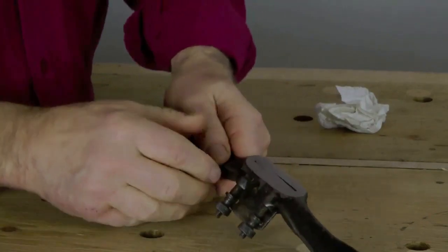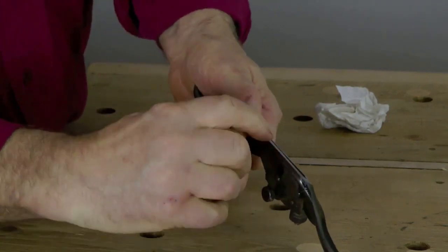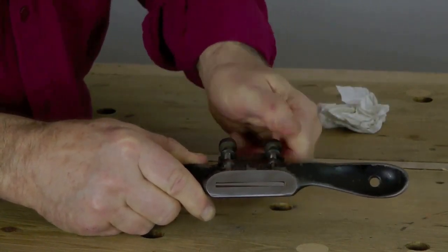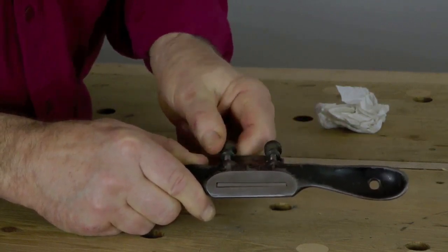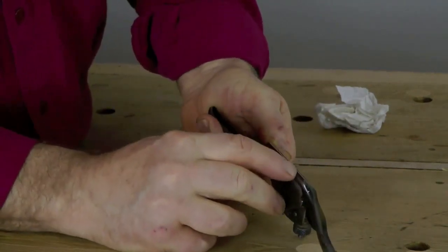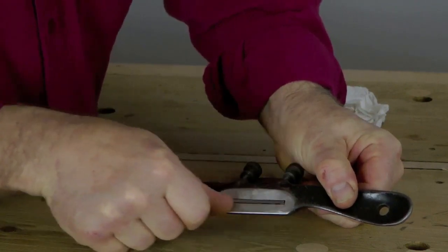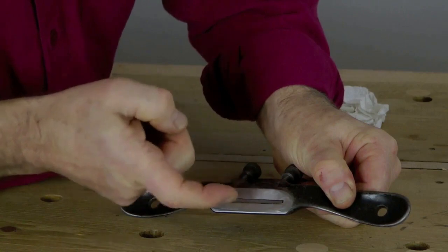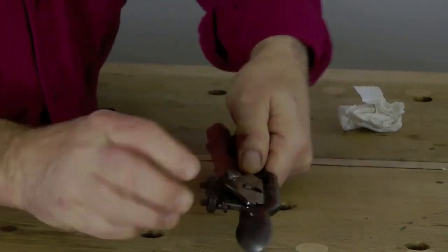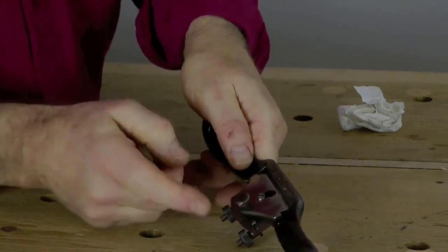So turning it over, because I can't show you this to the camera, I look down across this front edge here, and I see how much blade is sticking out, and I think you can see here that I've got a lot more on one side than the other. So if I was to pull this back this way here, and push this one forward, I could even up that blade. Then I sight down here, across there, and I just see a little bit, like a hair's breadth of blade sticking out. And there should be a gap between the front of the spokeshave and the edge of the blade for the shaving to go through. So that can't be too close. So that's essentially it, and I will try that on a test piece of wood, and I'll adjust that accordingly. And then when I've got that right, I make sure those are tight and this is pushed down against that blade, and then I'm ready to go.